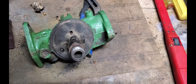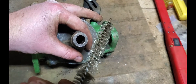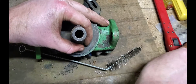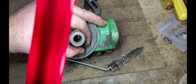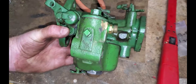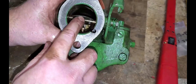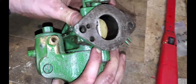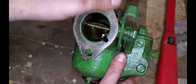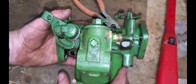Lastly, after you get your emulsion tube all clean, you want to make sure the stem of your carburetor is nice and clean. I do that just by taking one of these round wire brushes from Harbor Freight, shoving it down in there, pulling it in and out to get the inside all nice and clean. Now it is ready to reassemble. I've got the bowl put back together, the floats in with float set, the choke on this side, the throttle on this side, everything moving nice and freely. This carburetor should be ready to go back onto the tractor. Hope you enjoyed the video — if you do, please like, comment, and subscribe. Thanks so much.